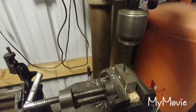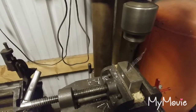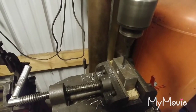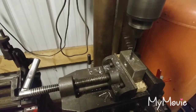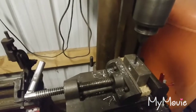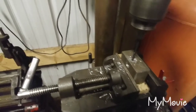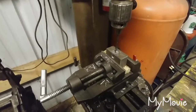I came down three-eighths of an inch on center from the front. The hole's drilled three-quarters of an inch deep. I came down from this face over three-eighths of an inch — three-seventy-five. Now we're through. Now I'll show you guys how to tap it.